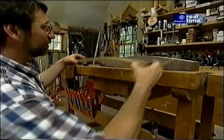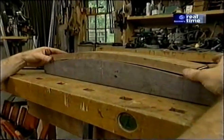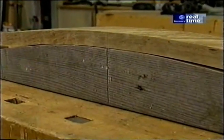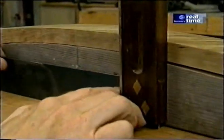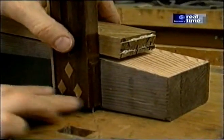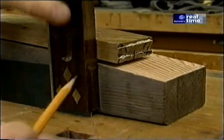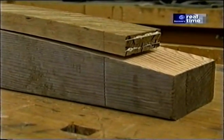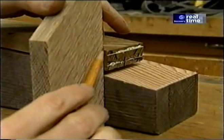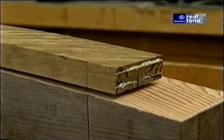The bending form has a dual purpose — I can now use it for layout. I have a center line on each of the slat blanks, and I'm just going to line that up over my center line. Then I can take a square and slide it over to the line equivalent to the shoulders on the tenon, and put a mark right on the top edge of the slat. I also take a piece of three-quarter inch scrap material, slide that up against the layout line, and mark the length of the tenon. Then I'll transfer those marks all the way around on both ends.